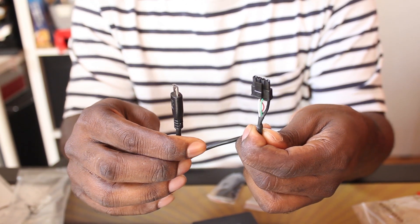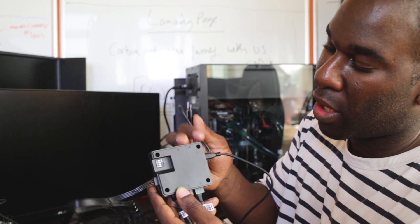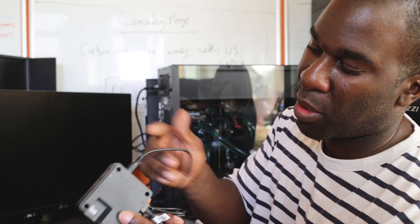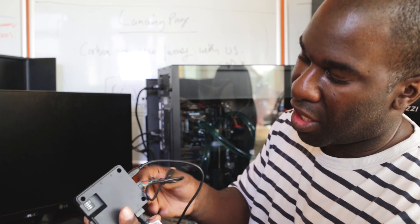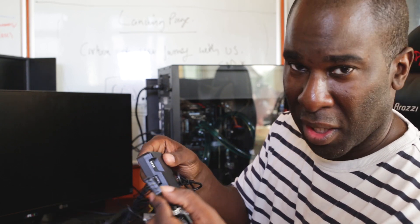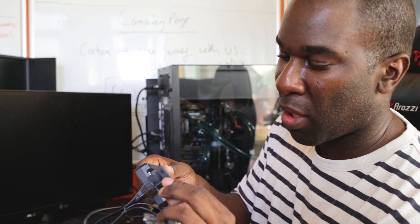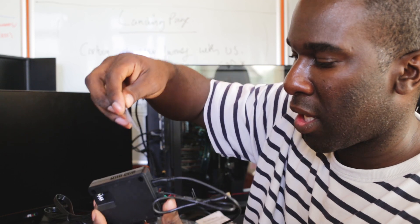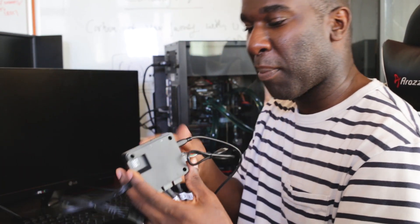This smaller cable — about 10 centimeters long — is the bridge connector with micro USB. If you want to connect more controller boxes together, you use that cable and you won't need the separate USB because it's already handled via micro USB to the first controller box. That's how you chain them — just get another box like this and connect it up via micro USB. It would be nice to see a slimmer power connector instead of Molex, since Molex with its four pins takes ages to connect.